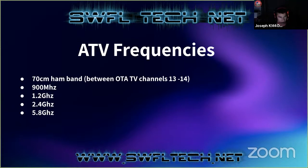But the problem with 2.4 gigahertz is that it is extremely crowded with a lot of Wi-Fi routers, and almost every consumer electronic that has radio uses 2.4 gigahertz or 70 centimeter on the 433 megahertz band. But 2.4 is so overly crowded that it's not a good idea to use this band for amateur television, for what we're going to talk about. And then we have 1.2 gigahertz, which is kind of just the same story as 900 megahertz. Penetrates a little bit better than 5.8, but the antenna size is kind of large.